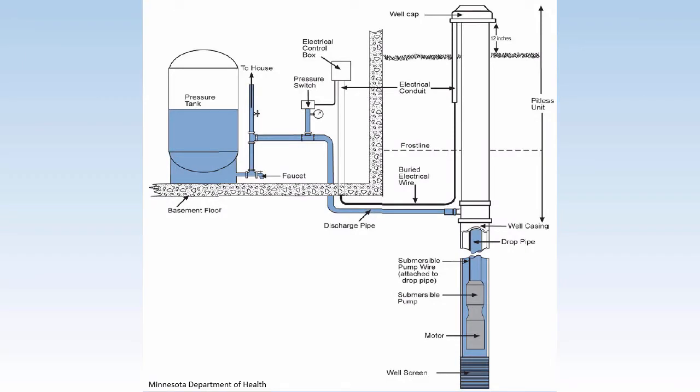One of the most common problems with private water systems is the lack of consistent pressure. Assuming your system is properly sized — meaning you have an adequate pressure tank and well pump — the best way to provide consistent pressure is to be sure your pressure tank maintains the proper air pressure. To check this, the tank has to be drained. Typically, the recommended tank air pressure is just a few psi under the low-end setting for the pump to kick on. If you haven't been shown how to do this, we recommend having your contractor show you the first time. Checking your tank air pressure every six months or so may help you identify a potential problem before it becomes a pump cycling issue.